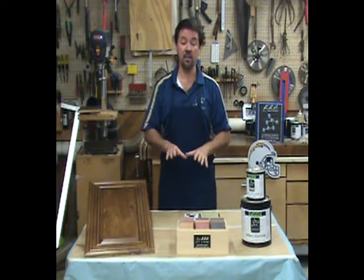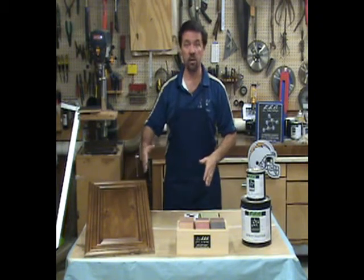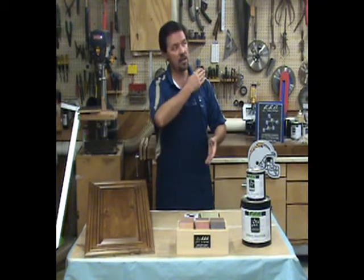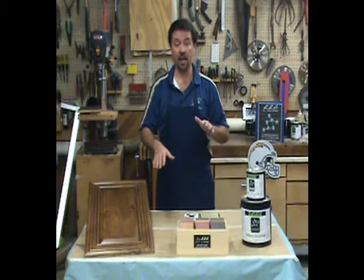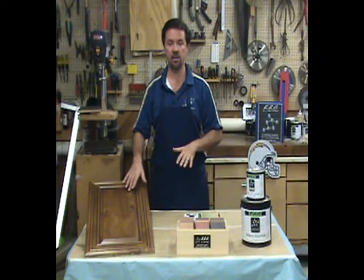A lot of contractors do the trick of taking all the doors and drawer faces off, laying them flat, spraying all those out, and rather than bagging off the entire kitchen, they'll come back with the Brushmaster and brush out all the carcass and framework of the cabinetry. Saves a lot of time that way, and the clarity and so forth matches up exactly with the Spraymaster.